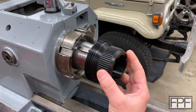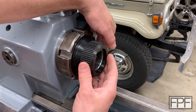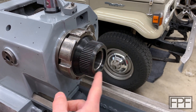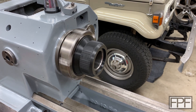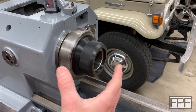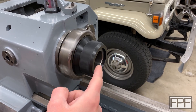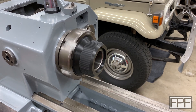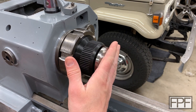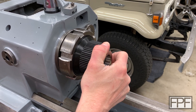So how can we solve both these problems? That's where the spindle nose protector comes in. It has the same keyway, so it fits over the spindle just like this, and then the captured nut turns, drawing it in. So we've already solved one problem. If I turn this lathe on, this guy's not going to be clanking around anymore. As you can see with this spinning up, there's no dangerous movement up here — this is running true to the spindle.